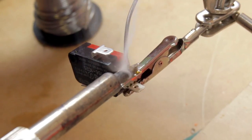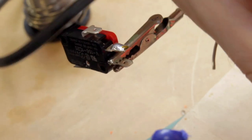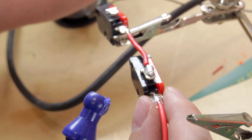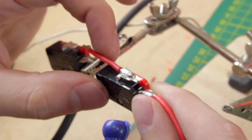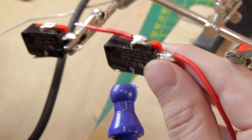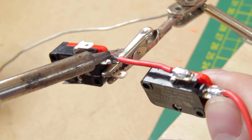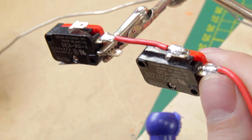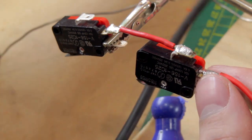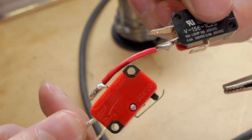See, this is why handy hands are almost essential for soldering, because they're really handy. What? I know, right? Something that's a really nice touch to do when you're soldering Nerf things together is to make sure that there's no twist in your wire. So when you're joining these two switches, keep them in the right orientation while you solder them together, because that'll just make the circuit sort of fall into place in the right spot when you go to glue everything together. Because now these two switches naturally want to stay in the right orientation. If they were 180, it would constantly be trying to turn.